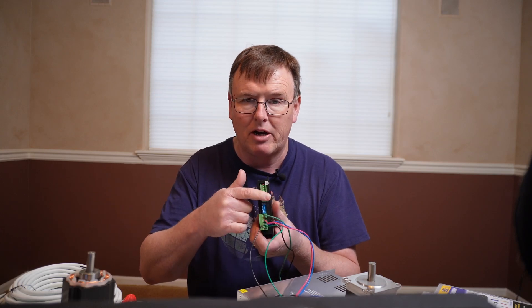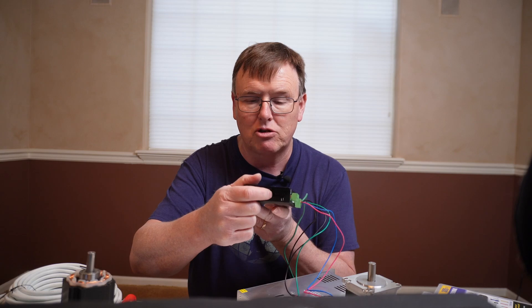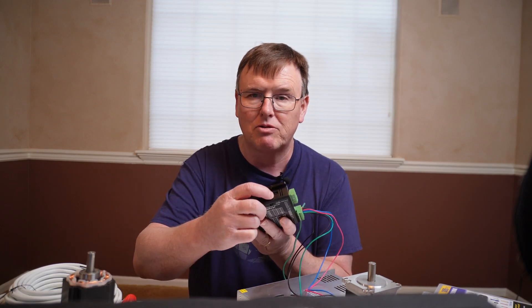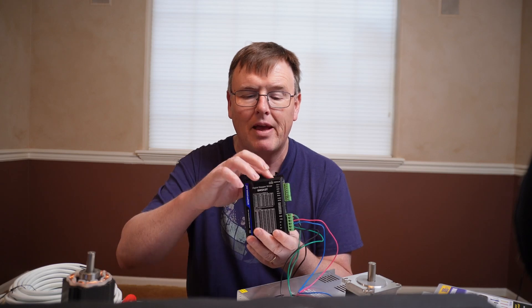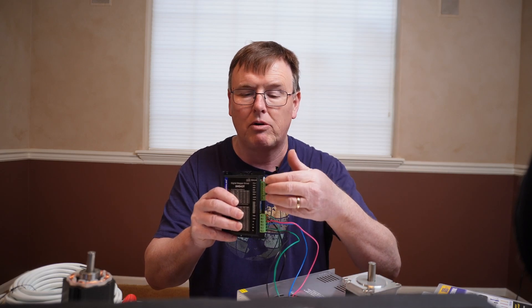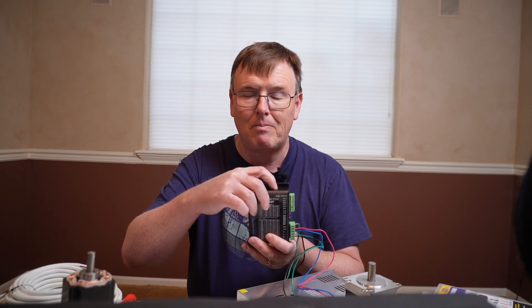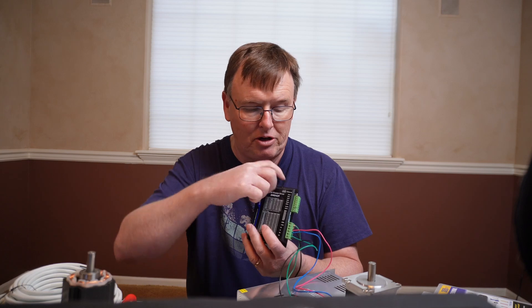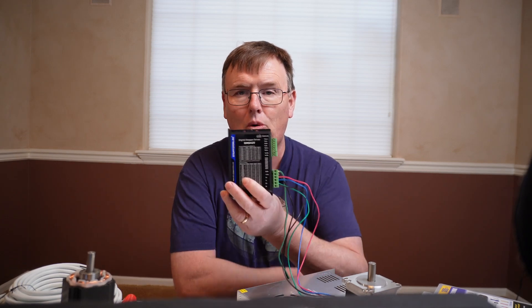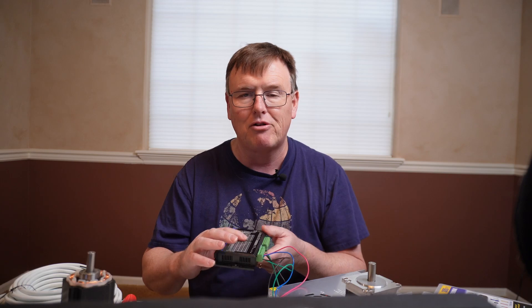I haven't talked about any of these switches and I'm not going to cover the top switches in detail, but one word of caution — just like the power supply had a special voltage switch, there's a switch on the top of the stepper motor driver. This is huge and cost me a couple days when I built my first CNC. I didn't know this switch was there because older models of this driver didn't have it. That switch tells the driver what voltage is coming in from the external source — in our case an Arduino Uno, which sends out 5 volts. I had mine toggled to 24 volts. You need to toggle it to 5 volts. Make sure you flip all four of your drivers right away.